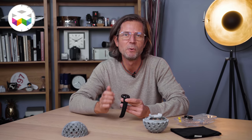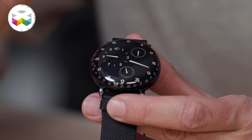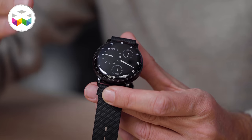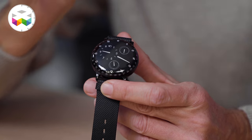Let me explain how you read the time. In a certain way there is a regulator aspect to it, with this central minute hand. But unlike any ordinary regulators, the hour sub-dial moves around the central axis in 60 minutes, and the 12 o'clock position always remains vertical — that's where you will find the Ressence logo. There is no seconds indication. On previous Type 3 models you could see a 'runner' turning on itself in 3 minutes to show the watch is running, but with this new BBB version that information has been removed, in keeping with the strict minimalist approach.